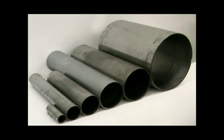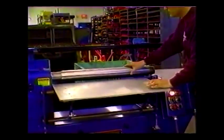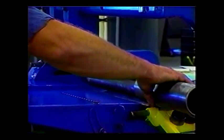Whenever a larger diameter part is needed than can be produced on the top shaft, a slip-on tube is required, as changing pressure does not produce different sized parts. The slip-on tubes are simply steel tubes that have been developed on an individual basis, using the desired part OD and spring back of the blank for development criteria. When slipped on over the top shaft, they produce the part size that they were developed for.